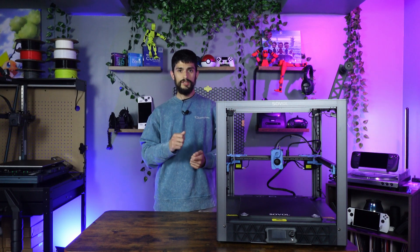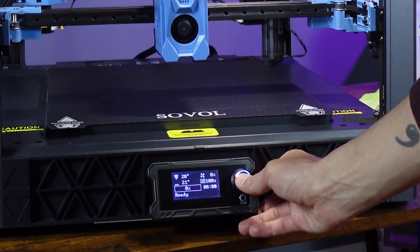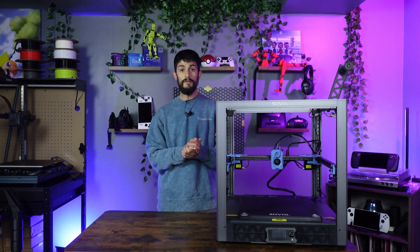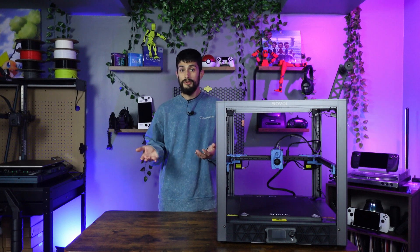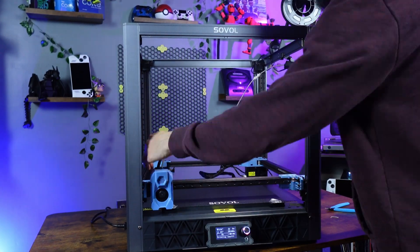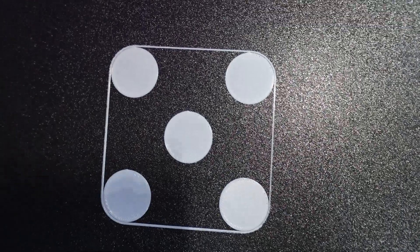Once it was put together, it was time to power it up. We grabbed the included USB, installed it, and started the machine. Scrolling through the little menu — the display can barely fit any information, maybe three or four lines of lettering at max. I found the Z offset calibration and just let it do its job. What confused me was that it did a little test print after calibrating the Z offset, giving you a visual indication that you have a good first layer — new to me and cool to see, but I feel like it'll get annoying when I forget it does the test print and then send a real print just for it to get messed up.